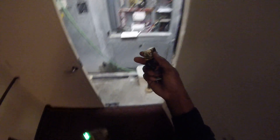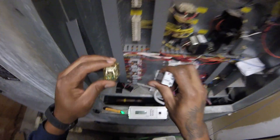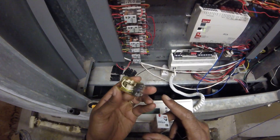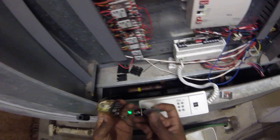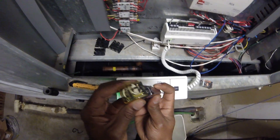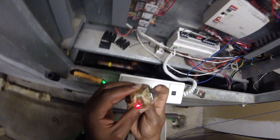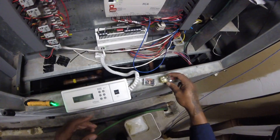I got two different kinds here. See, this one has a resettable and this is just like a clear type. But you can just put the nine-volt battery on here — you can see the red light and you can hear it kind of click on the inside, or at least I can feel it. You can test it. You can see that — that relay is good. This is the style right here, just with a nine-volt battery.